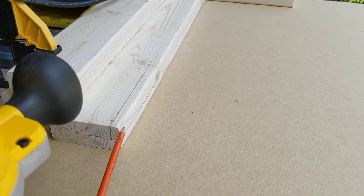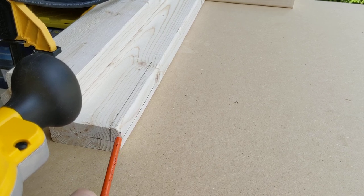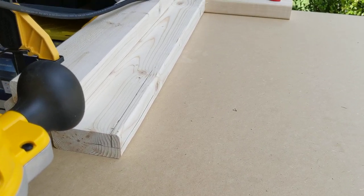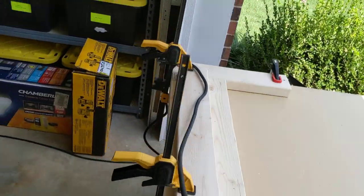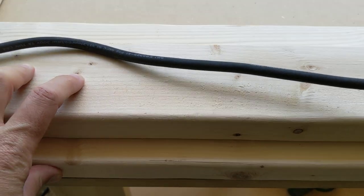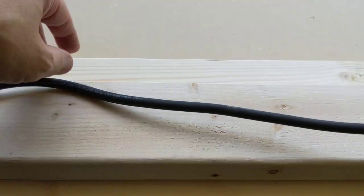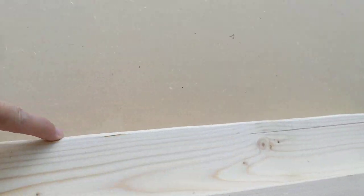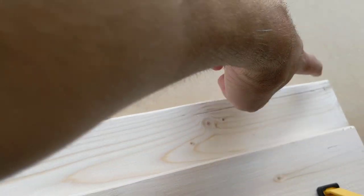Let's get this going right here. What I've done was use some clamps to set up my base, so all I have to do is just throw my 2x4s in one after another and just run my router across here. That'll make a perfect rabbet cut. Then I'll throw all my other beams in and they should all be even. So let's try this first one.